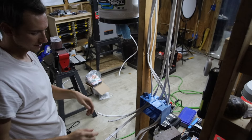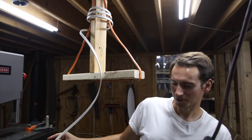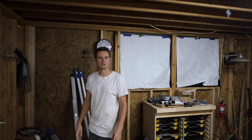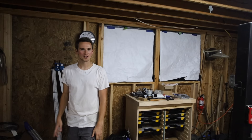Downstairs we got stairs, living room, and the kitchen done. The living room light is going to have three different switches — this is the first one, and we started running some three-way wire but we just ran out, so we'll need to get a little bit more to finish. We'll have one more over here by the door so you can turn it on when you come in. The final thing after we run that one wire is to finish the workshop — just two more lights. We're almost there, and after that we'll be able to get our inspection. We'll probably finish that tomorrow and hopefully schedule the inspection next week.